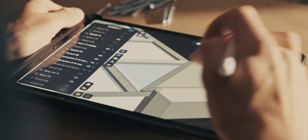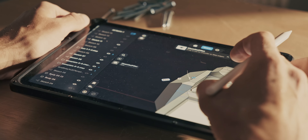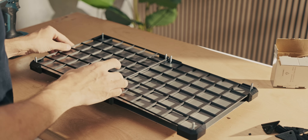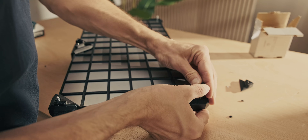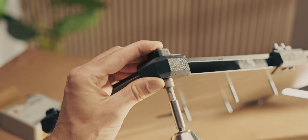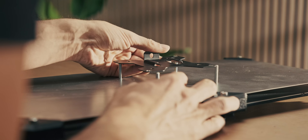Sometimes it's really fun to accommodate hardware that doesn't fit exactly. In this case I have bolts which are far too long and I'm not really interested in going to the store to buy the exact right size. So I'm just upping this little corner piece a little bit, rounding it over, and giving it some chamfer so it looks kind of funky. After printing the grids and corner pieces, we put the grids in place first and attach the corner pieces to the bolts threaded through the project panel. This is a little bit difficult because I made them M5 instead of giving them a little more room, so it threads into the 3D print straight away. Somehow I also miscalculated the length of the bolt — I'm sure I measured it in CAD to be exactly the same length, but somehow it's sticking out quite a lot.